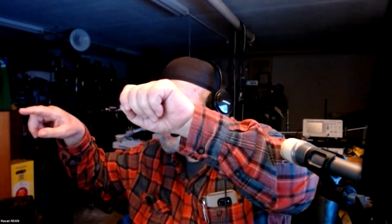I mean, I said to some people, I worked satellites for many years, and I've said to people, running satellites without an SDR is like running blind. You can't see what's going on. Whereas with satellites, if you have the panoramic display up, you can see every signal from the CW beacon down here all the way up to the end of the passband up here, and you can see everything in between. You can see the CW signal beacon bouncing up and hitting minus 74 dBm. You can see a signal higher up in the band hitting minus 60, 14 dB above the beacon. That guy's breaking the rules and he's ruining it for everybody.